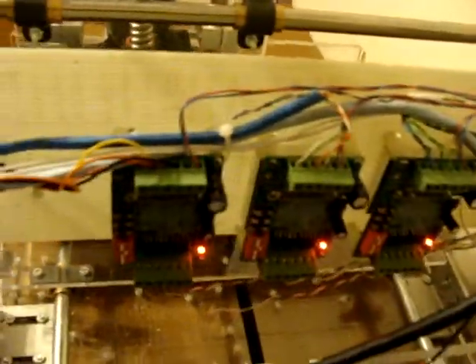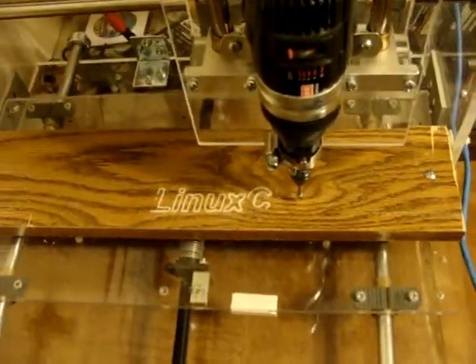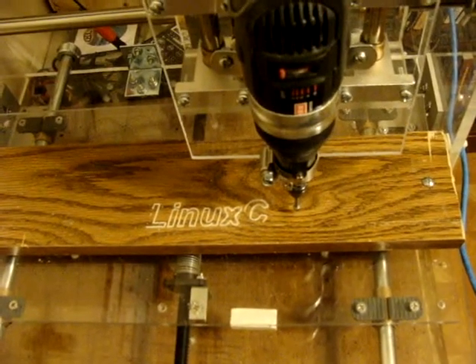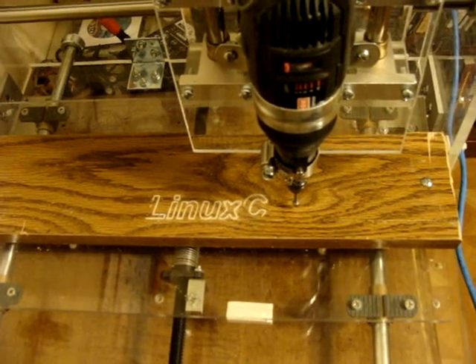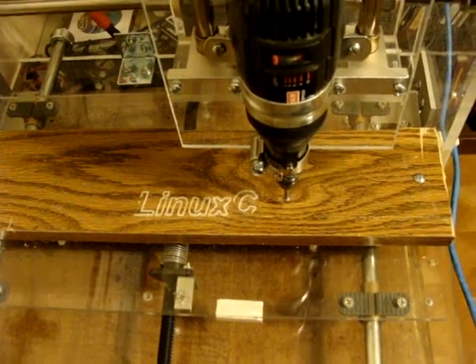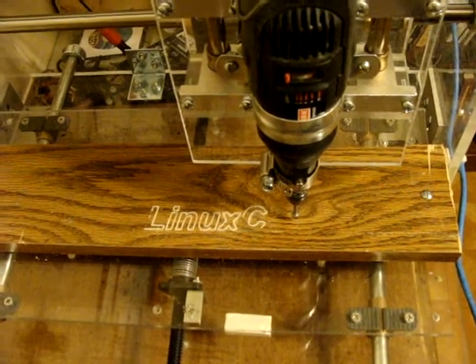Using these wonderful little controllers — my BOB boards. Since the last video I added pull-up resistors; 470 to 1k works fine. It's much smoother x and y-axis operation, but as you can see the z-axis needs help. Well, so much for today. I know I could lower that bit down and start over, but anyways.